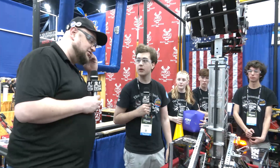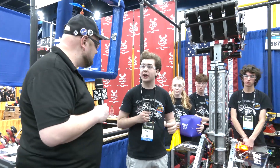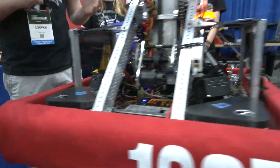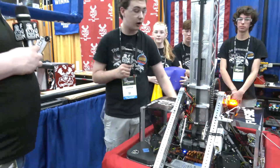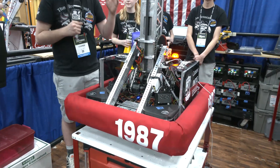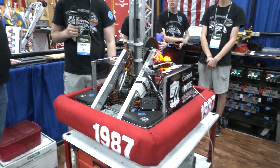One last thing — from an autonomous standpoint, have you made improvements for World Championships? Absolutely. We've been hard at work getting our Limelights to work properly. We have four Limelights on each corner of our robot, and we run a pose estimator that takes the position of all of these Limelights based off AprilTags — all three AprilTags on each side of the field. Using that, we calibrate where the robot is in coordination with our Pigeon gyro, which is deep inside the robot. Overall that's been a super big help in making sure we're staying on point.